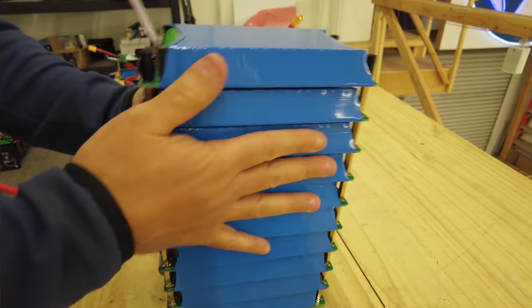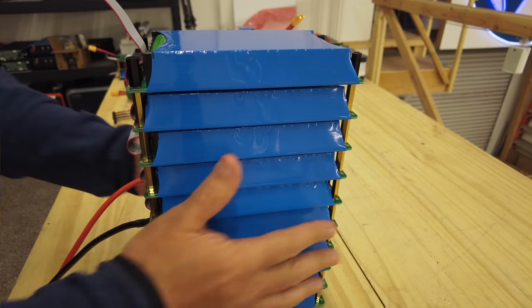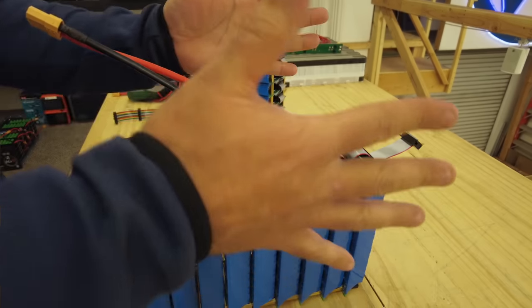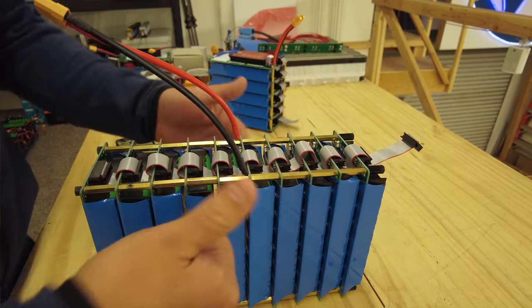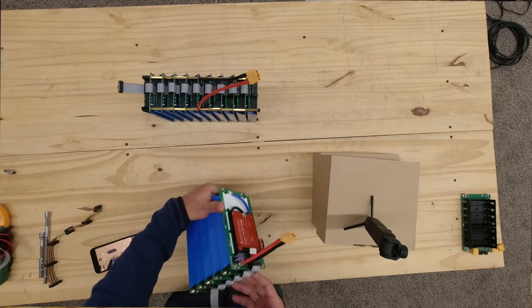You've made a 900 watt-hour battery pack at 24 volts, which is a relatively safe, low-voltage level — you can't get electrocuted. But you do have to be careful, as this is capable of 1C continuous power output — that's the equivalent of one capacity, or about 900 watts, or in other words about 50 amps.